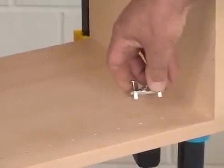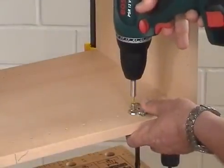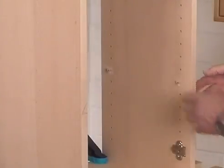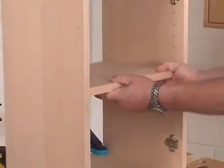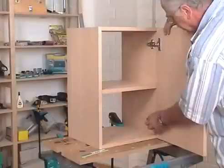If the cabinet should have a cabinet door, you can fasten the mounted plate of the concealed hinge directly into the series of holes. Also, shelf supports for variable intermediate bottoms can be inserted. Finally, the cabinet door is just engaged into the mounting plate.